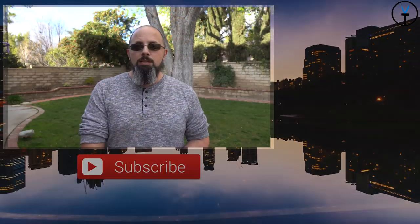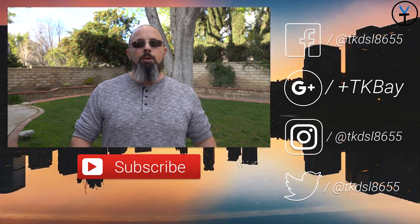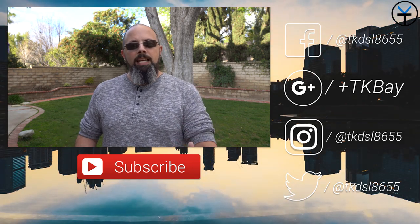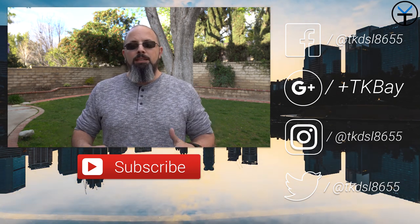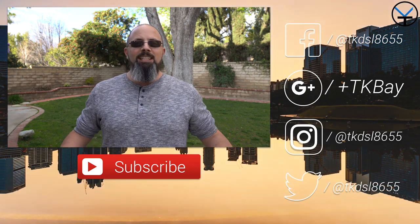I switched the low cut filter on to give you a comparison — this should sound a little better as we're able to remove some of the low humming noises in the background. This works really well at about two to three feet away from the camera, since it is a shotgun microphone — the further away you are, the more it struggles to pick up. At about $80, with its small form factor, included cables, and versatility, I think this is a great deal from Saramonic. If you're looking for better audio out of your vlogging camera setup, the CamMic is definitely a strong contender. All the information will be in the description below — thank you for watching and subscribing, I'll see you in the next video.